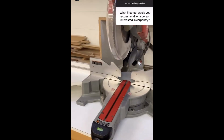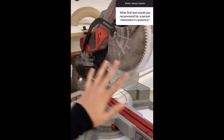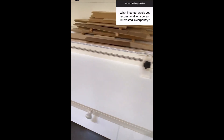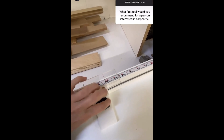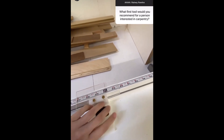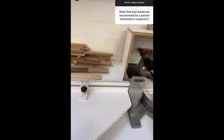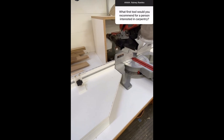What I've done here in my shop are a lot of various upgrades. If you were to buy this piece of equipment, it's just the saw itself. What I've added is a fence system, a roller, and a stop block so that I can set a length for something I want to cut. Say I want to make it two feet — I set this here, tighten it so it doesn't move, hold my piece of wood up to the stop block, and cut it. I know that it's perfectly 24 inches long and I don't have to measure and draw a line every single time.